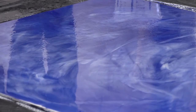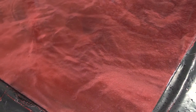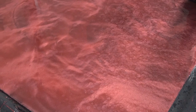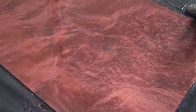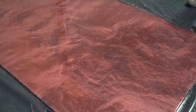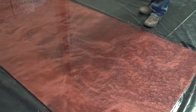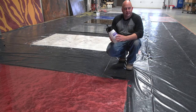Make sure that when you're doing this you have a lot of ventilation. This is a solvent, and if you're in somebody's basement with a pilot light on or something like that, it could create a huge fireball — we've actually had it happen. So please make sure all the pilot lights are off and make sure you get some fresh air.